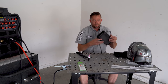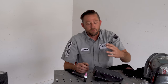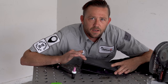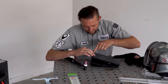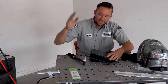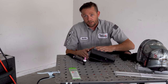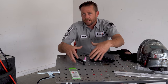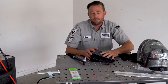Let's talk about the foot pedal. This is your on switch, your off switch, and your complete control of that machine. Every single bit that you step on this — even to that first point where you can just hear a click — that's the on switch telling the machine to fire up. Once it's lit, you increase to increase your amperage, meaning the amount of energy going into the part. Just like a car, you step on it to go faster, let off to decelerate. Every single bit of that machine is controlled right here at your foot.